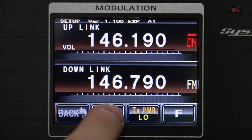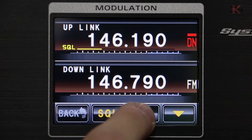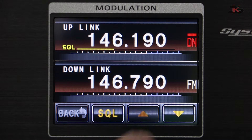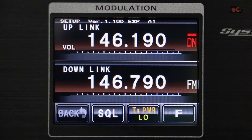The squelch button on the front is only adjusting the receive squelch on the repeater itself. Previously we set it to about midpoint to start, just to be covering any background noise and things along those lines, and everyone seems to be able to get in without a problem. So we'll leave it at that. Touching squelch brings us back.